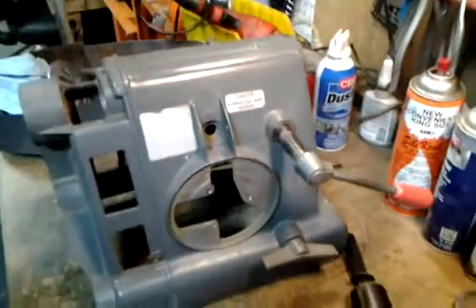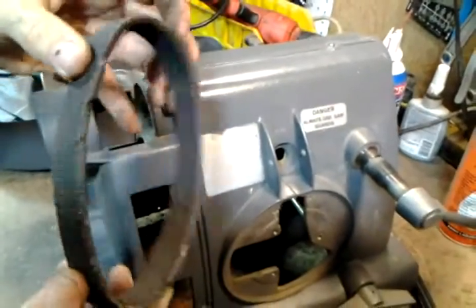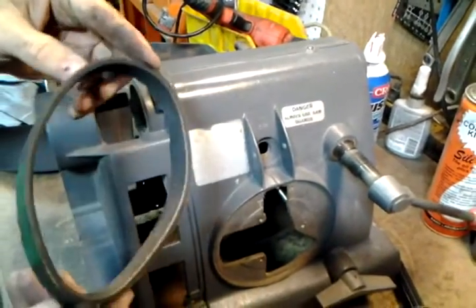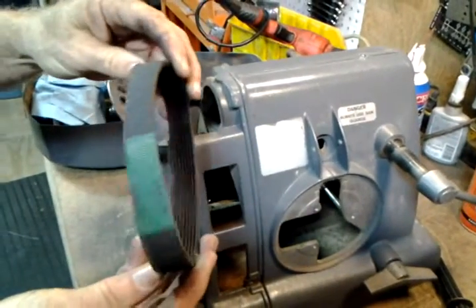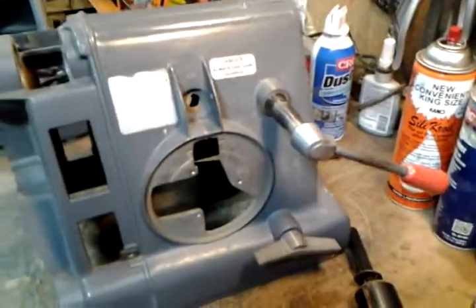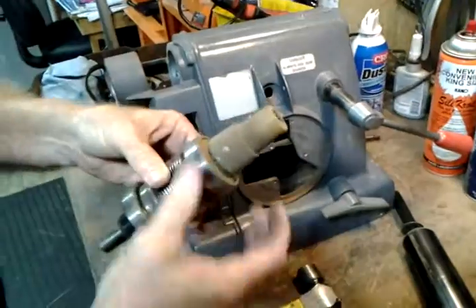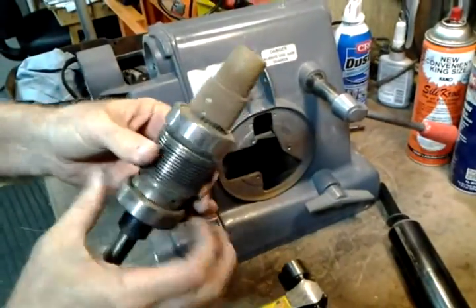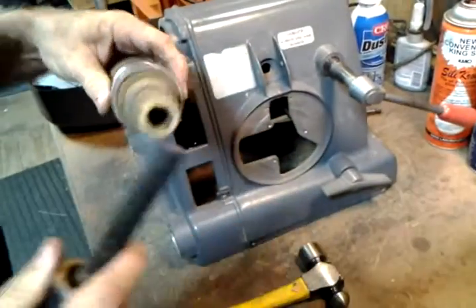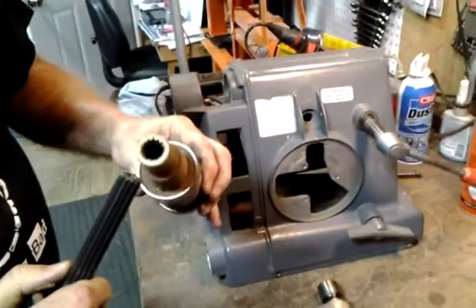You have to do all that just to get to this belt. And you can see how damaged that belt is — it's just really ragged. I replace any belt over 25 years old or if there's any damage, and that one is clearly both. Here's the drive sleeve, and this bearing here barely turns — that one's very rough. We'll evaluate all that: the bearings, the condition of the drive sleeve itself, and see how it interfaces with the quill or if there's any damage there.